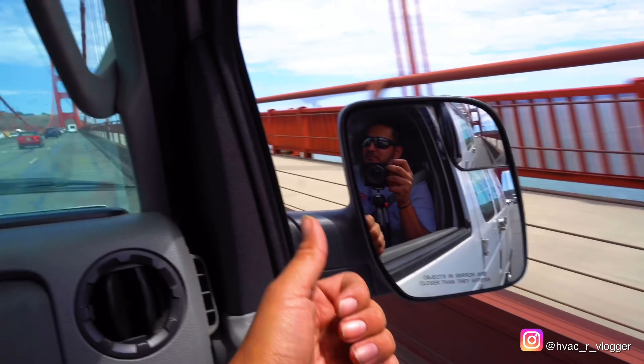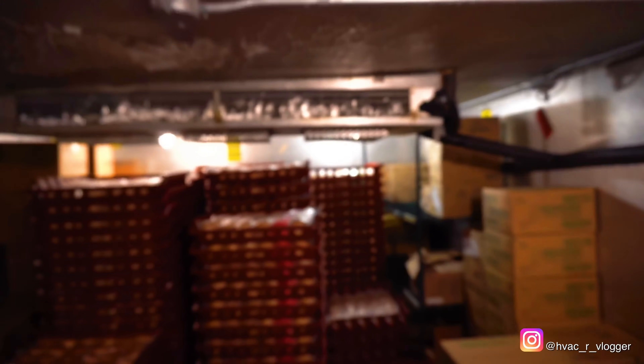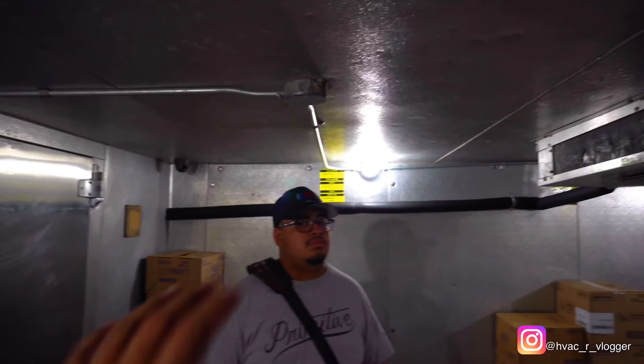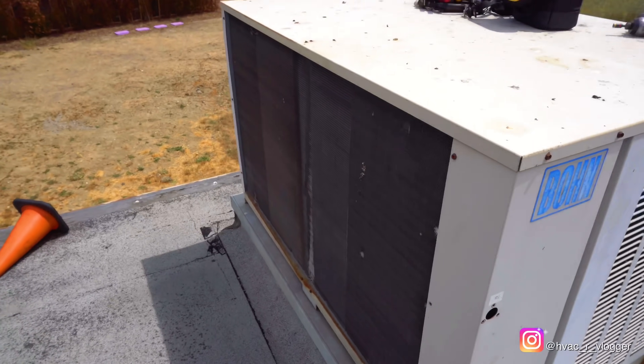All power is off, everything's off. 55 degrees, both fans are off, check the freezer — everything's off. No fans, nothing. So let's go check the roof, because since both of them are off and both of them run off the same power, it's going to be something in the condenser. Maybe a fuse popped or something. So the whole condenser is off.